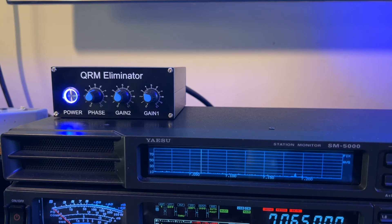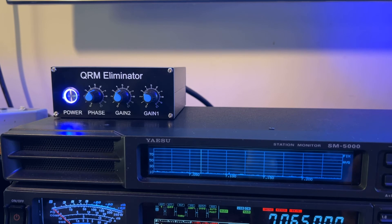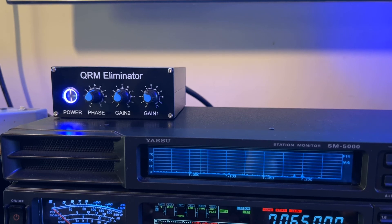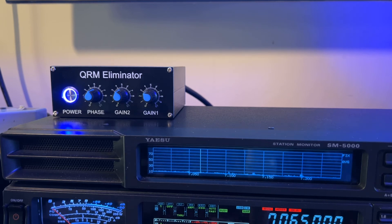We just wanted you to see that, and since there's been a lot more interest in devices like this of late because we're all dealing with noise unlike we've ever dealt with before - a lot more electronic devices that can cause interference to our radios. My rule of thumb is: if I'm in a store and I see some new electronic gadget that's going to plug in somewhere in my house, that's a potential for radio interference. I've had it happen a couple of times - I returned the devices. One was a wireless phone charger, another was an LED light bulb, and there was a wall wart power supply where I was able to get a different well-filtered power supply.